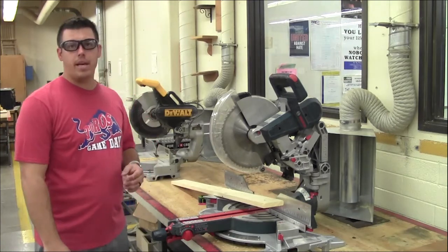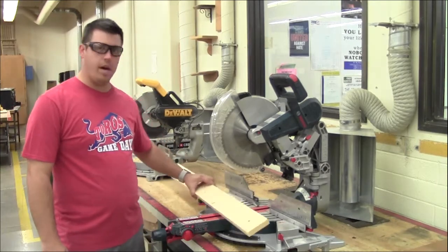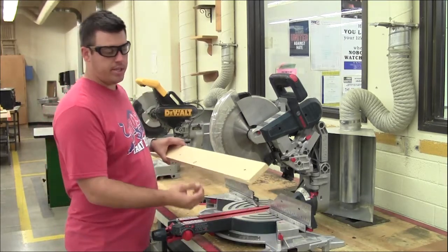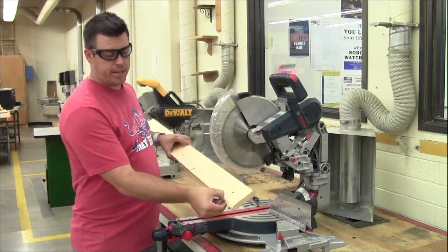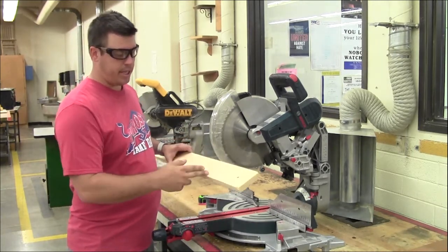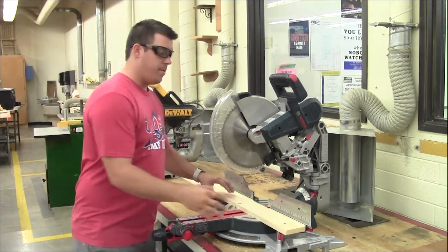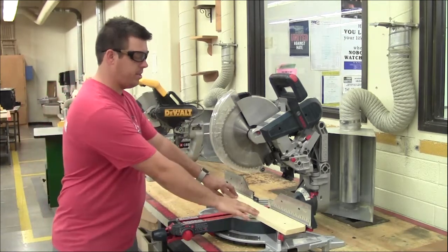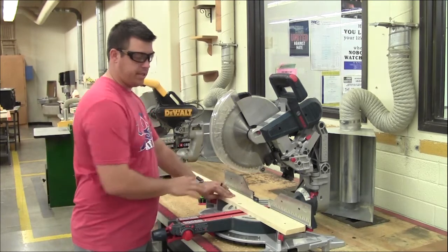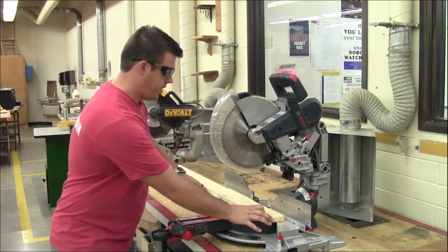The most common cut you're going to make on a miter saw is going to be 90 degrees. Let's say we have a project and we need this 1x4 cut to about a 12-inch piece. Now if I cut it at a foot length the way it is right now, I have a chipped edge that isn't very straight or even. So the first thing I'm going to do is find the best spot to cut to get a clean starting point. You're going to push this piece of wood firmly down on the tabletop and into the fence — no gap between the wood and the fence.